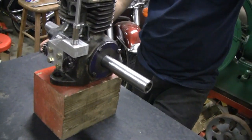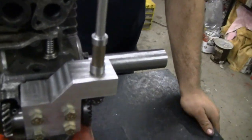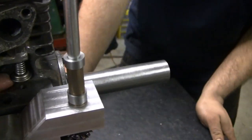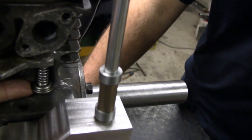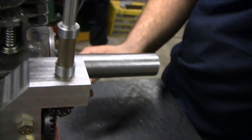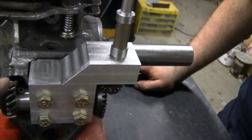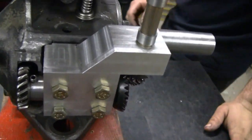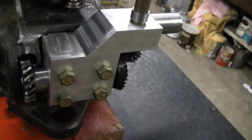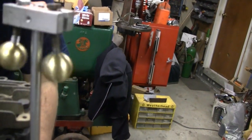All right Tubes, we're going to wrap it up for the day. Let's summarize what we did here. We've got a valve in here — we're not going to use a tappet, but atmospheric pressure; that's the way a hit and miss works, it just sucks the valve in. Got a nice light spring. We hooked the block up on the side here — Mike is still going to do a little trimming. The gear drives that shaft and it goes over here, transfers that, and goes up here to our governor balls.